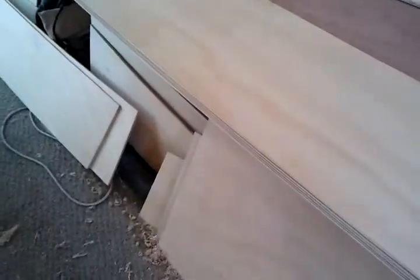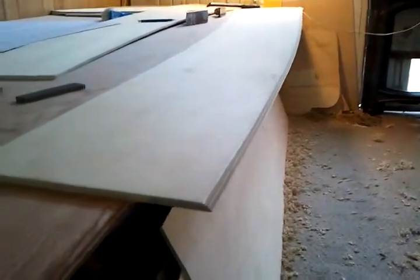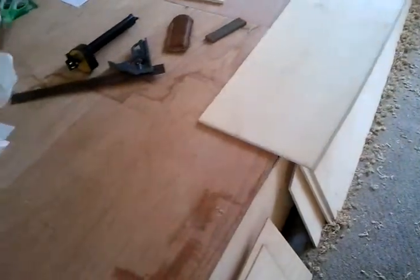Hopefully you can see there that plank one is almost done. Look along the rolling bevel there for a minute — it's a little bit of a lump in there in the middle. I'm not going to get too religious about it because if it gets within four millimetres of where it needs to go, you can fill it with epoxy. Well, that's a theory anyhow.